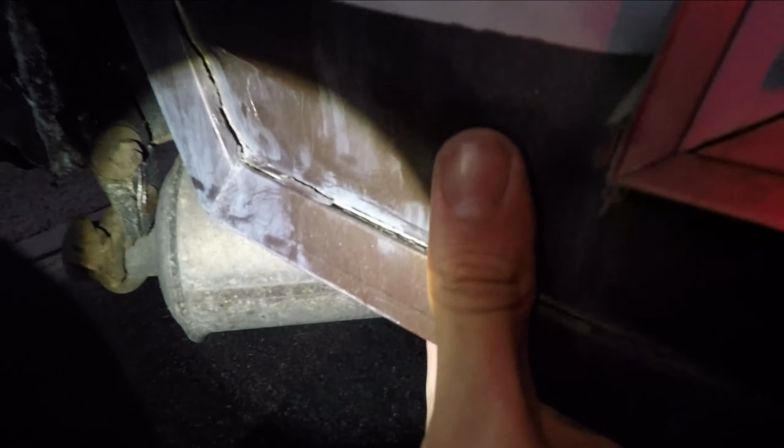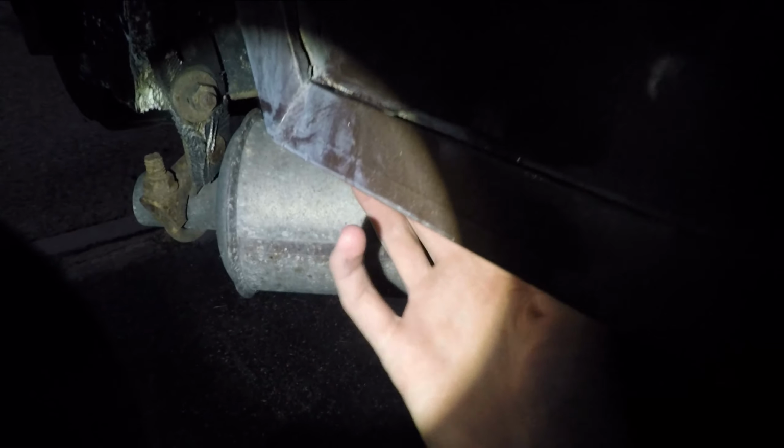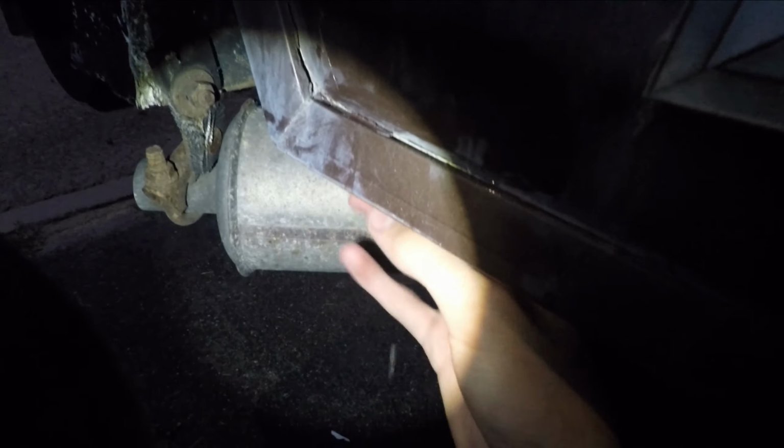So it was just sitting in there, coming down, and then it would pool here a bit. Even when I did this, moisture is coming out. And so no wonder it was dripping from right here. It was just following, sitting for so long, and then it would be at the bottom of the seam. Sitting, and then after so long it just drips out. So I need to seal this as well. I don't think it was a roof leak, I think it's this. So that's kind of good, because that's a lot easier to fix. Despite the fact that I'm fixing the entire roof, it's still just peace of mind. Anyway, I'm gonna finish up and then we'll chat in a bit.